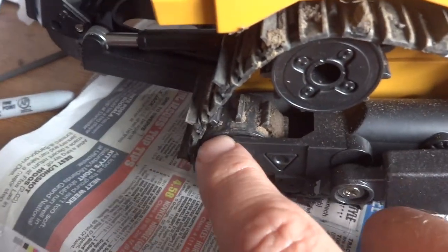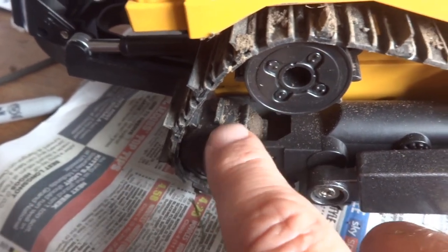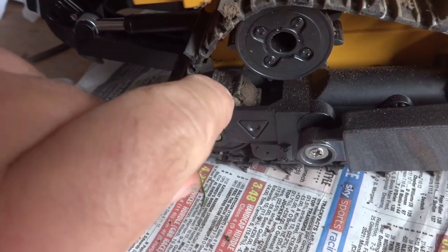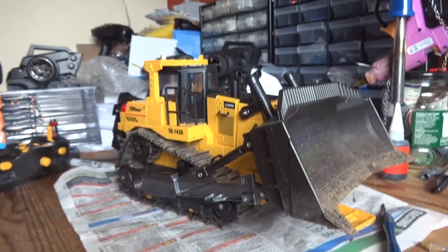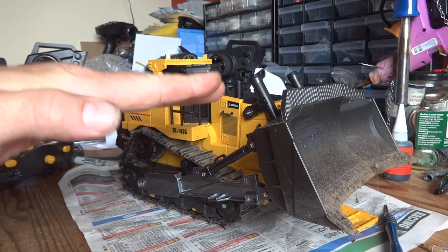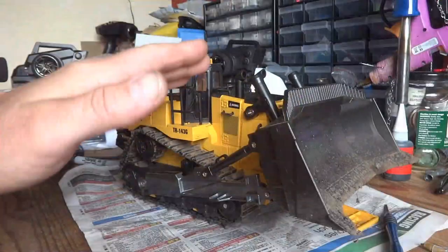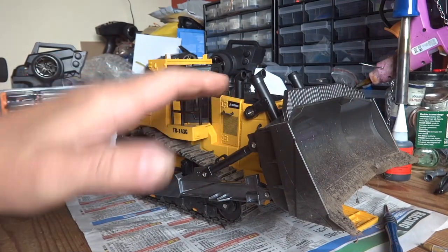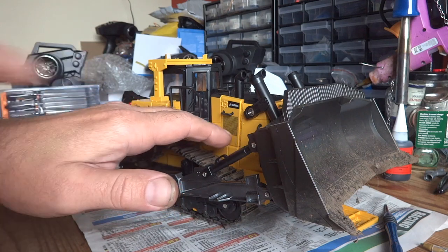One problem I've noticed is that these lower track sprockets do tend to get gummed up with soil. You can actually see a portion stuck in here that I've mostly cleaned out. As the dozer runs, soil builds up until there's a ring around the entire surface of the sprocket, and you go from the sprocket holding the track flat to the track conforming to that ring of compacted soil — and this caused one rubber block to peel up at the corner.